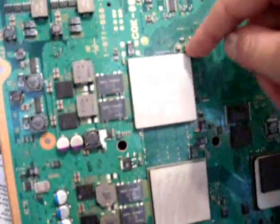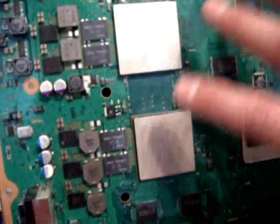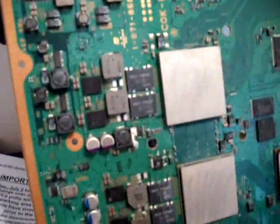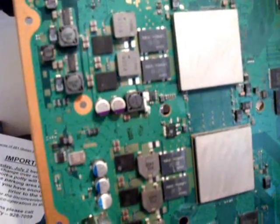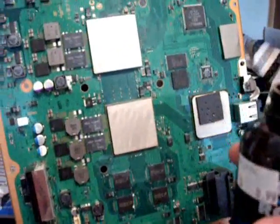We've got the board propped up, and as you can see it's just on a little bit of an angle there, just kind of leaning up against my bench. What you're going to do is pour flux along here and let it drain underneath the chip, and then onto the second one and drain underneath the chip again. It'll take a couple of minutes because this stuff is not fully liquid — it's pretty thick. Do not get this on anything you don't want it on because it is super, super sticky and will take forever to clean off.